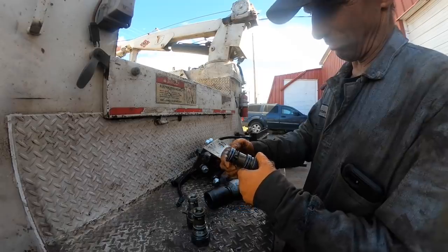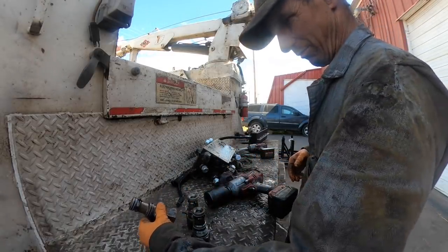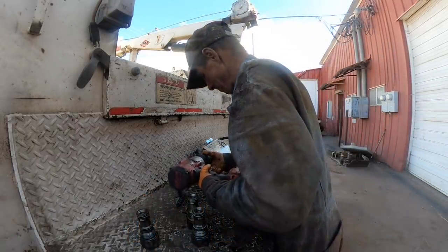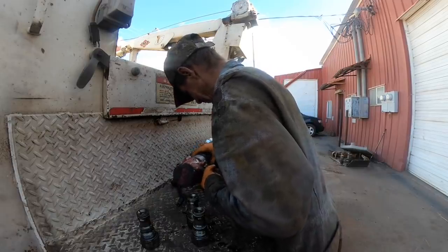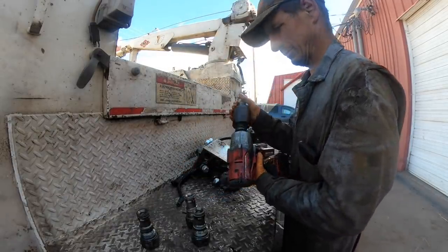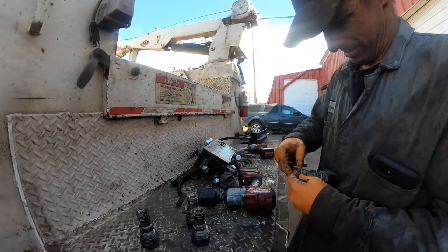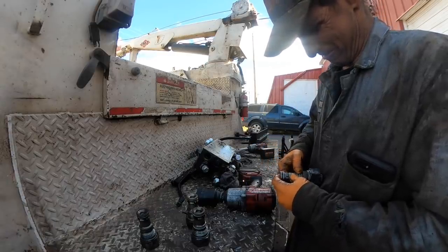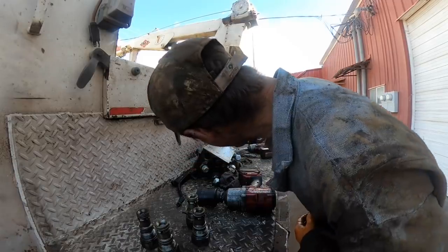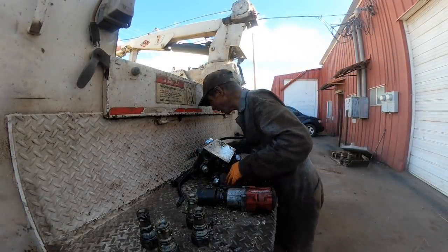Somebody's resealed this one at one time or another. It's completely different seal-wise than the rest of them are. This is the same song and dance. Those are just hard and brittle. They're not going to hold 6,000 PSI.